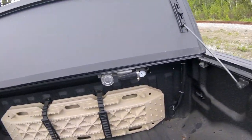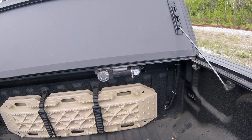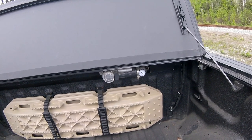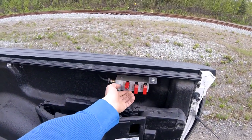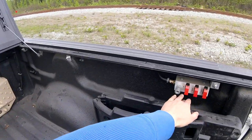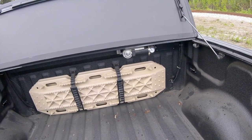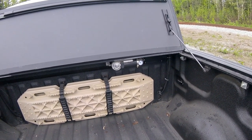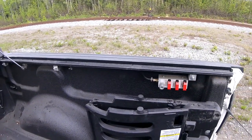What I like about it is the way I set it up — it'll stop when it reaches a certain PSI, so it just doesn't run constantly. I can swap tires and it'll shut off. Here, I'll show you how it works. All right, so it just hit 115 PSI and that triggers the pressure switch to turn off the relay, which cuts power to the compressor and turns it off.